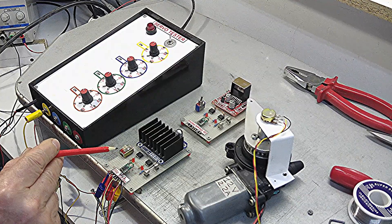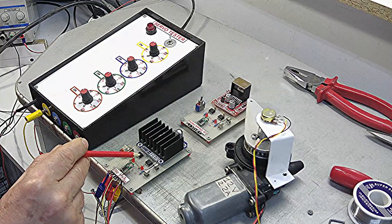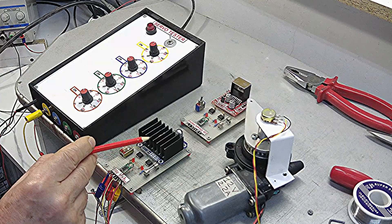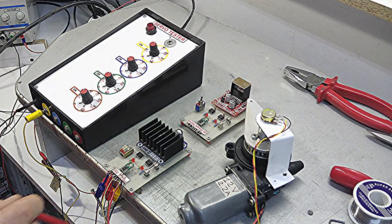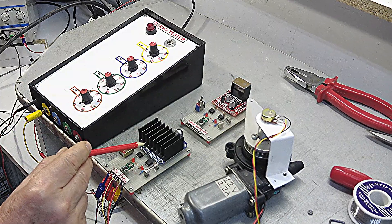Here we have the motor fuse, the 12 volt switch. Here I mount two photocouplers — these are important. If the drive breaks, the 12 volts would burn the servo electronics, up to the Arduino which is inside the servo tester. So it's a protection.